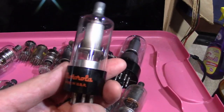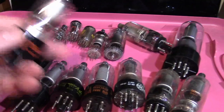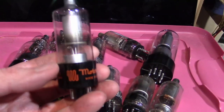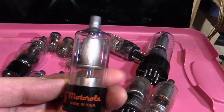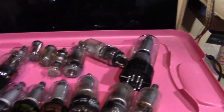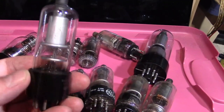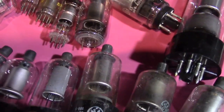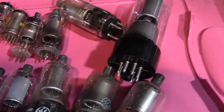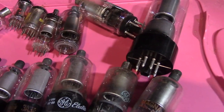Later they went to this, with the complete shroud covering the filament — maybe to improve the efficiency, decrease the voltage drop. This is an early 1B3, that's what they used right after that. These came out in about '46. It's a nice Motorola one with the early Motorola squiggle logo, new old stock. And here's the RCA one I showed earlier. Then we progress to the 1G3, and the 1J3 and 1K3 I showed earlier.